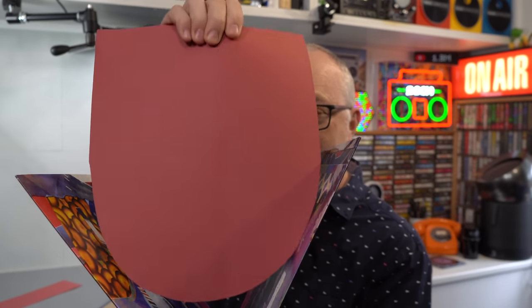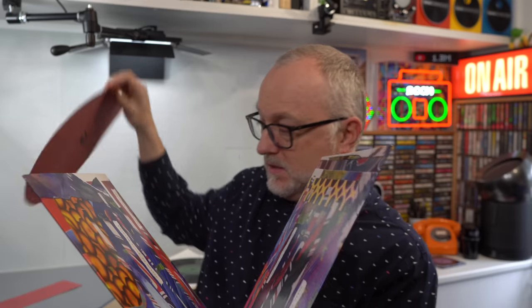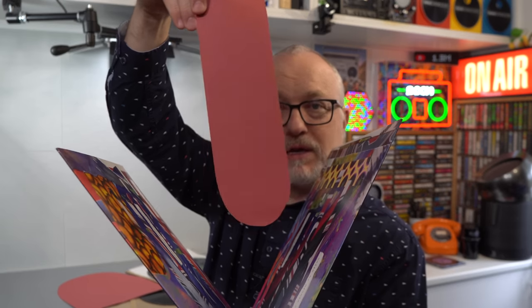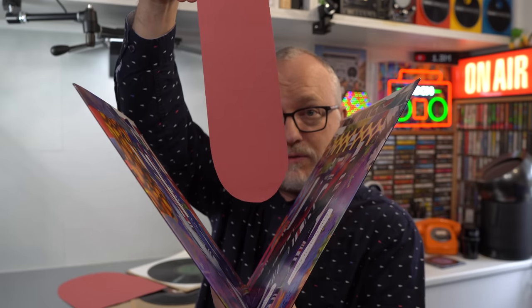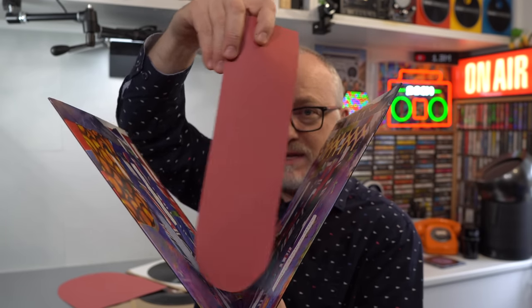So this is a 3 mm stylus here, okay? I'm going to keep the groove the same width, but as you can see, it's touching both walls nice and easily. Now, let's get a piece of card that's around a third of the width of that. In fact, it's a little bit over, so I'm being a bit generous here. But this is equivalent to a 1 mm stylus travelling in a 3 mm groove. And look what happens. It's right down the bottom. It's not even hitting the sides.